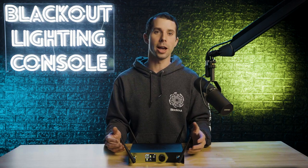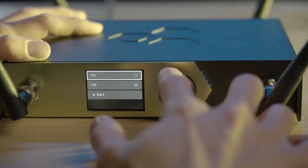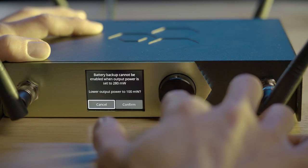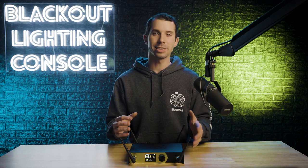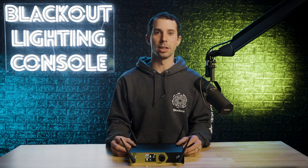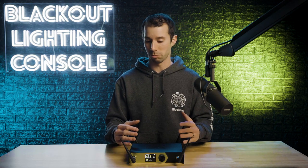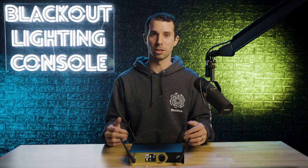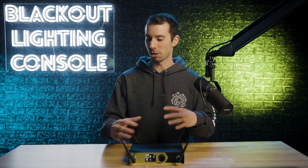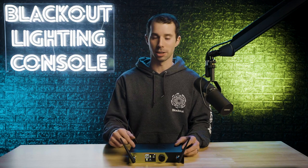The Stardust also has a small 15-minute battery backup, but it is disabled if you have the output power set to max 280 milliwatt. I find it slightly weird it doesn't have Bluetooth, as all of the other devices in the lineup do, and that's how you easily configure them, but I do respect that it's probably way too much wireless going on in this device already, and that would just clutter up the signal. It's easy enough to stick a USB into the back of this and click update firmware.